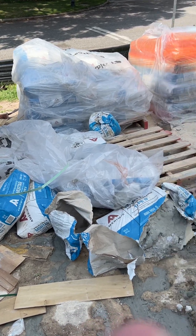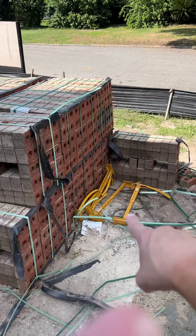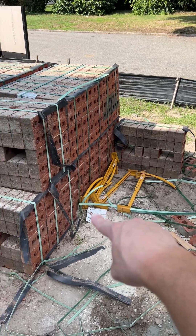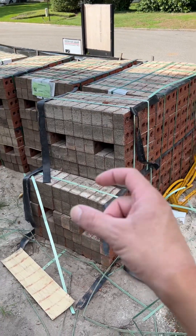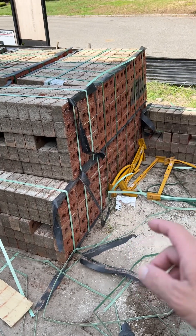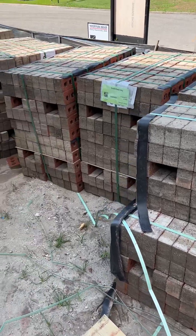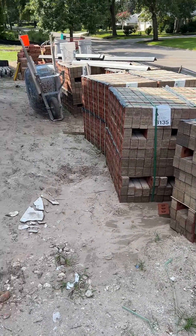If you're really laying brick as a brick mason, you've got your mortar pallets here. Those are brick tongs — that's what you carry the brick with. These are engineer bricks, so they're a little bit thicker: normally two and a quarter inches, these are two and three quarters. But I can carry nine at a time with those tongs, so that speeds things up.